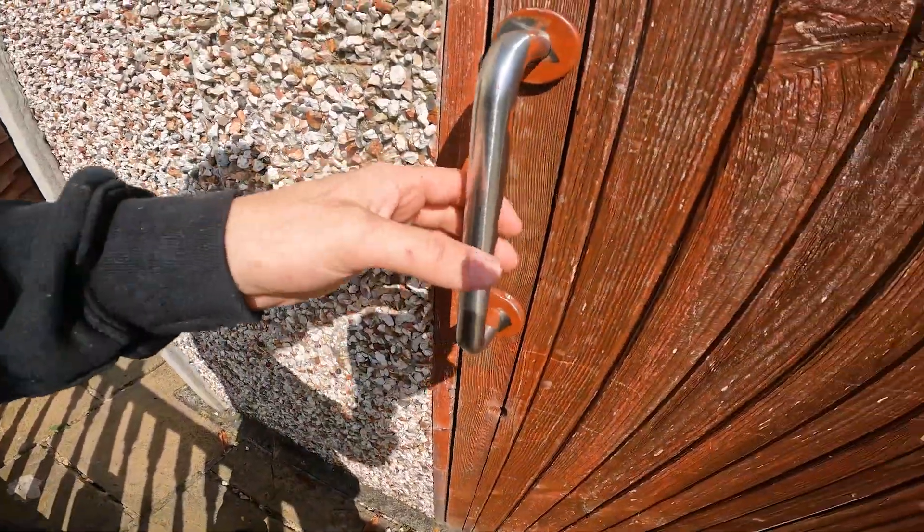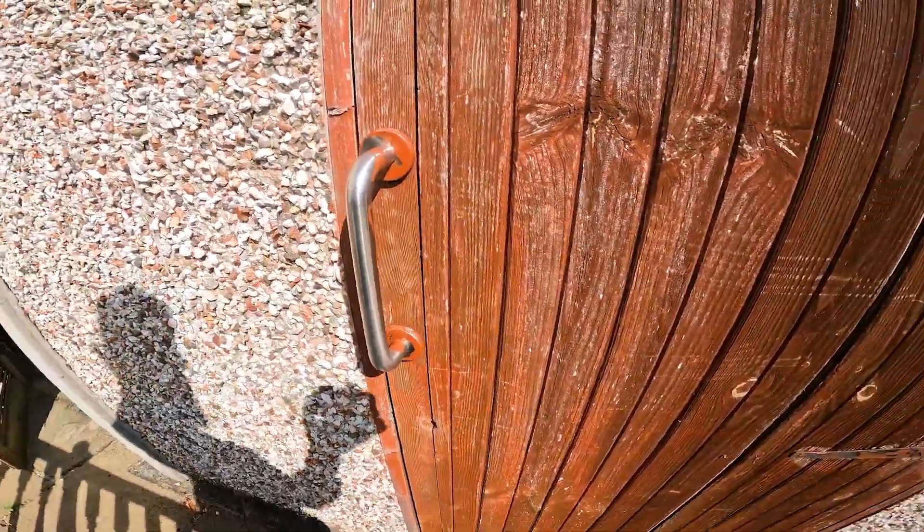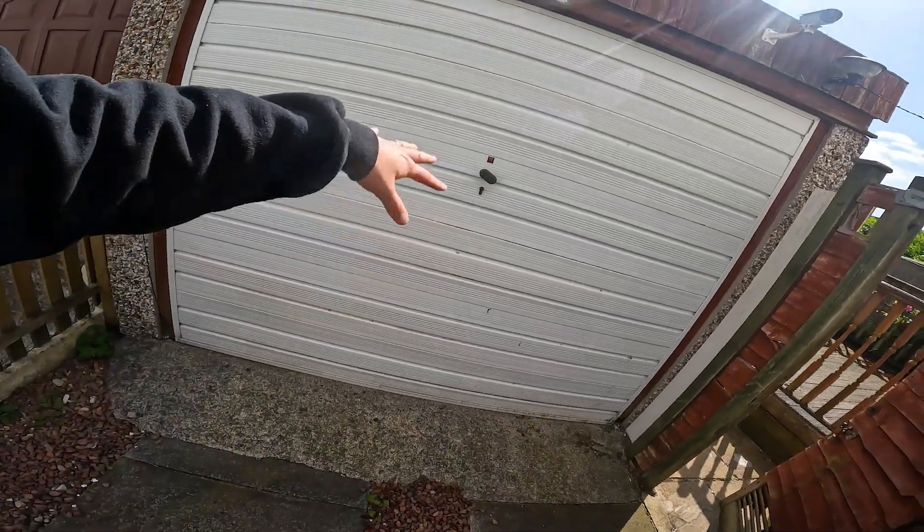That'll come under these flags. I can't get in here. When you're testing, if you've got a limitation - if you can't get somewhere - you've got to cover yourself, because there's going to be loads of live cables in there just hanging out. If I can't get in there, I didn't test it. So if anyone gets a shock, it's not my fault. You've got to cover yourself with this. Hopefully there's a key somewhere and we can get in there and test it.